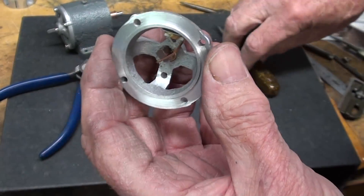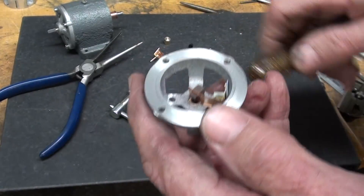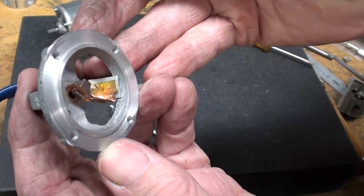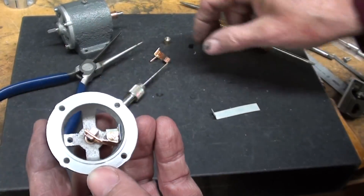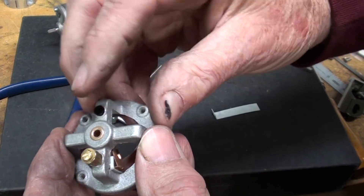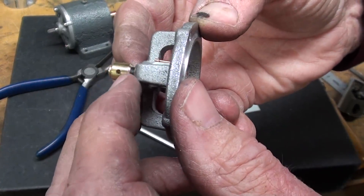And on this end bell, I also had to mill out a little material here on each side. Now they said to spot face it, but spot facing really wouldn't have been enough. But through that hole, they gave insulating paper, so I will cut that off to length. That lays in there like that, because these brushes and brush holders have to be insulated from the frame. So, cut this to length, and then put this in with a brass screw that goes through this little insulator, and then the brass binding post tightened up against the insulator, and then this other tiny screw that will be used to tighten the copper wire that goes in there.